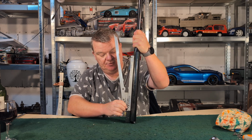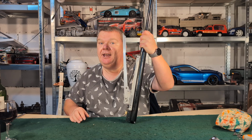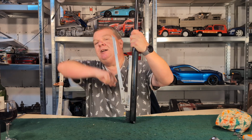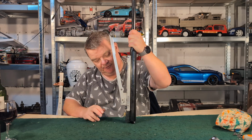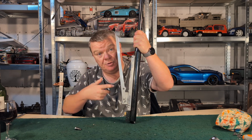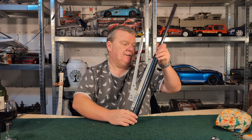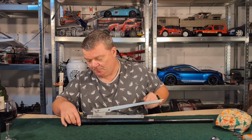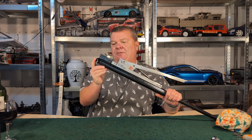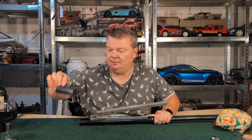Same as with the TX, at the end of this, by pushing up and down here, you can get a gauge for the preload that is inside of the gun, because you don't want to undo that and then everything twang out all over the place. So I can feel that that is the amount of downward pressure I need to undo that. I've got all the spring under control, and there you go. I have no idea what's inside this gun actually. I bought it second hand. It shoots quite nicely, but I don't know what's in there. So that is it. That is all the preload I had. Away comes the trigger unit. I'll put him there.